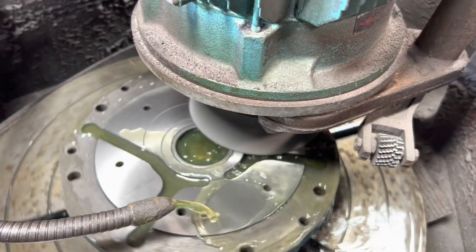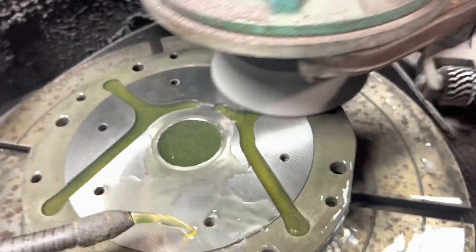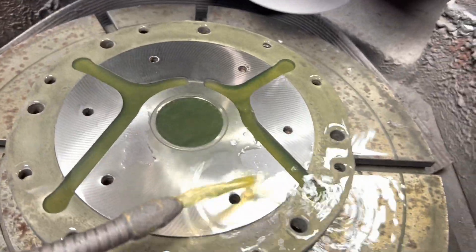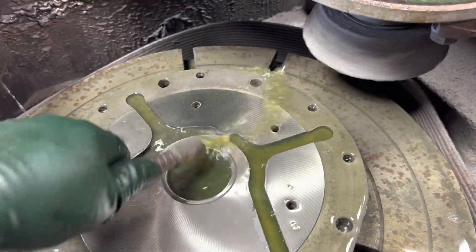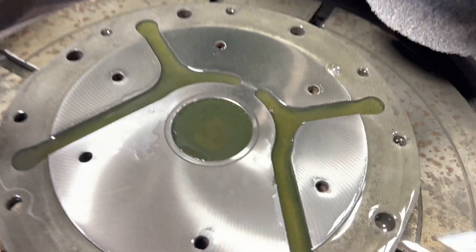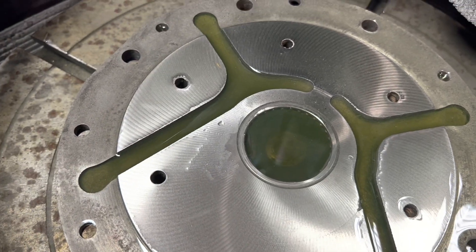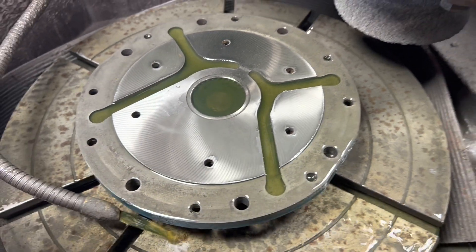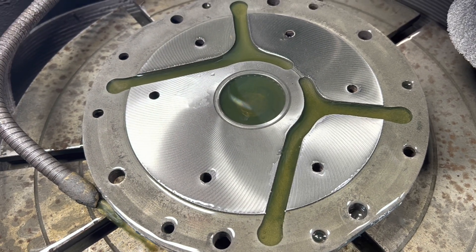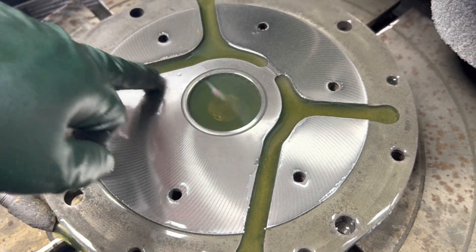Alright, coming back from commercial break - I think I'm done grinding here. I'm going to pull around and wipe this thing down. Oh, not too bad. Just that little spot - that's not going to hurt anything. At least I got a nice flat surface now that the pump can ride against. I don't think we can get hurt any more. We'll check how much we took off, then we'll make sure our end play is right. It looks like it just started to hit the bearing, but we're going to change that bearing anyway.